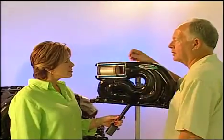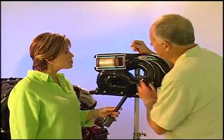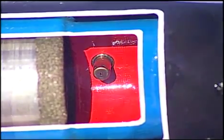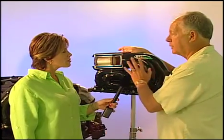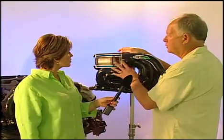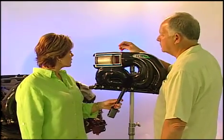Before we get started, let's talk about some theories and challenges we had in developing the catalyst. The first one was the O2 sensor, which you can see right in here. They don't like water, so we had to find an O2 sensor that would live with some water. There's not a lot of water, and we try to keep water out of there. But there is water, obviously, in a marine exhaust. Of course. The second thing was then what substrate to use.